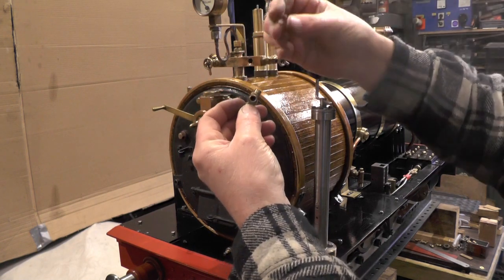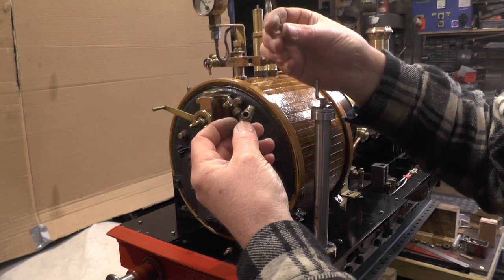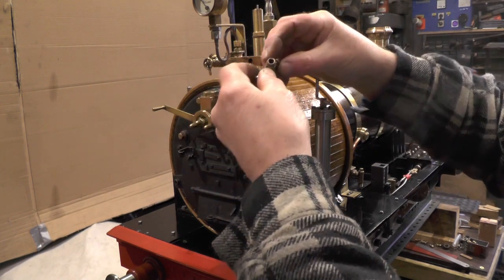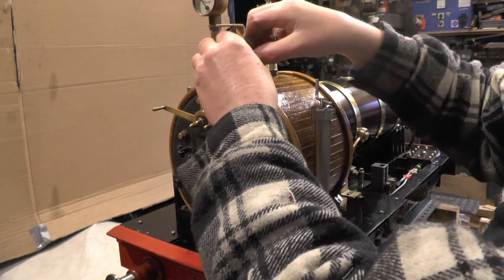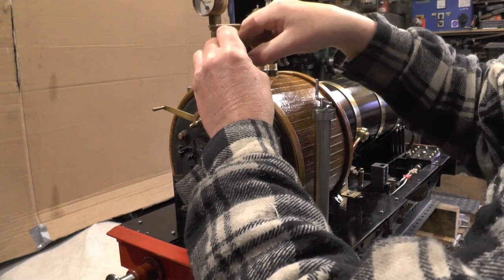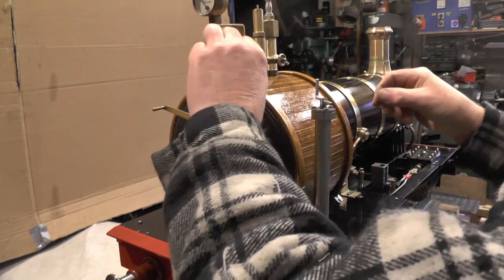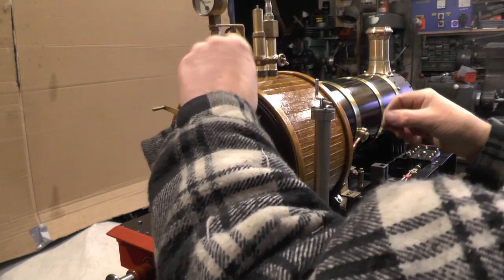You may have to rub the washers on some emery cloth to reduce them by a few thou at a time until you get your valve to face the correct way, when it's got the proper torque on the spanner to tighten it up.